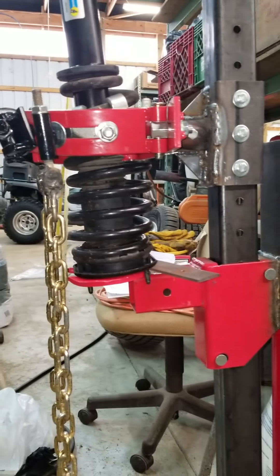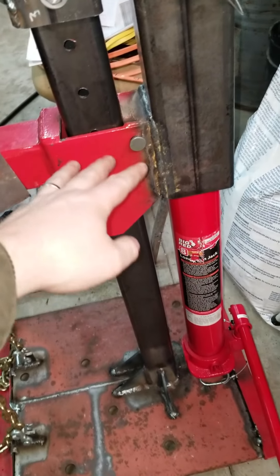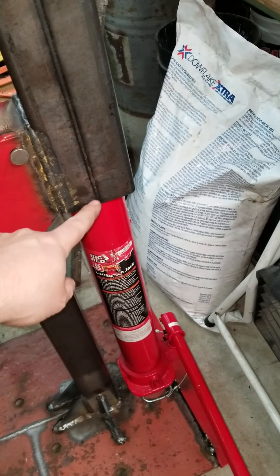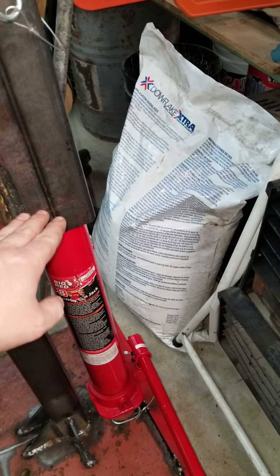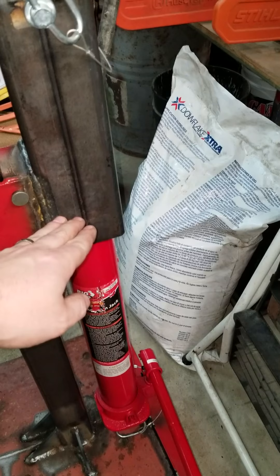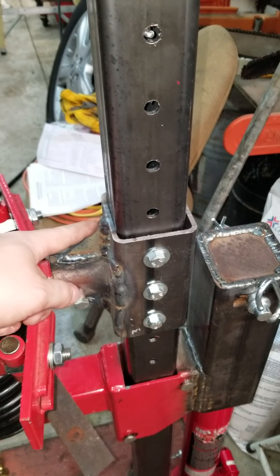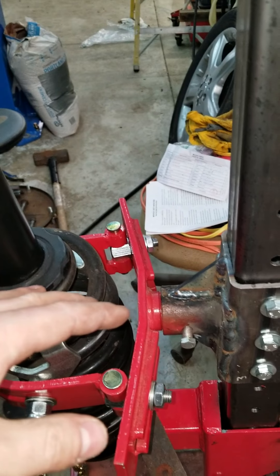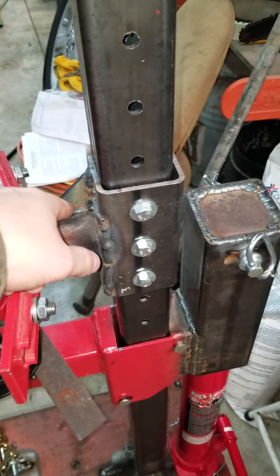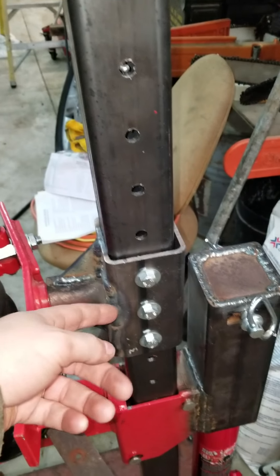No creaking, no cracking, no unusual noises or anything. I'll go around the whole thing and show you the modifications. This here originally came straight out, and the original jack would just bolt on here. I wanted to use a taller jack for further travel — this jack is about 12 inches, almost a foot taller than the original. The second I tried to compress the spring with the unmodified version, it buckled this sideways. So I cut it off here, cut the original tube, and welded it onto this thicker steel.